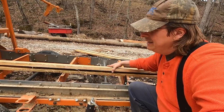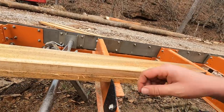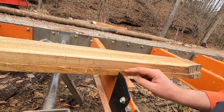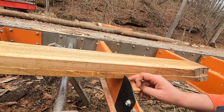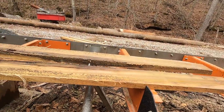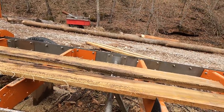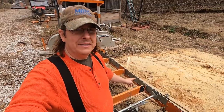And then this final pass I did, I put it on its lowest setting just to make sure. So that's the lowest setting the mill cut. That's a true 1-inch or a true 4/4. And you can see it just had about a 1/4 inch to play with there. So it cut fine. Again, got some core rot here, but got some decent looking poplar boards. So this tab obviously worked out great.